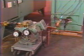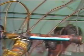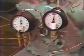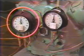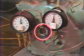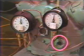This is the test setup in CC1 where we'll be testing a modified 38AQ. We'll close the hand valve or ball valve in the suction line to create our problem condition. The compressor you see is a 6E275. It's instrumented with an oil pressure differential gauge, a window looking into the inlet of the oil pump, a suction gauge, and a standard crankcase sight glass.